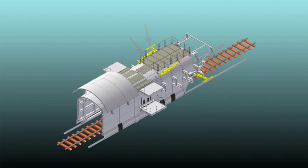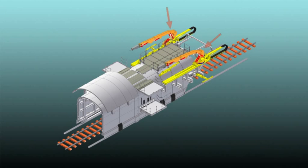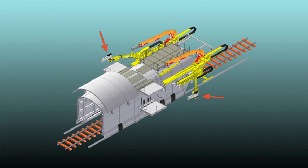Four hydraulic bracings stabilize the position of the portal during operation. Two slide tracks at the sides carry the multifunctional booms, which in this case are equipped with hydraulic breakers. Under them are two further slide tracks to carry the blast and bolt hole drilling devices. The total hydraulic and electric supply of the machine is provided by the power pack at the rear end of the portal.